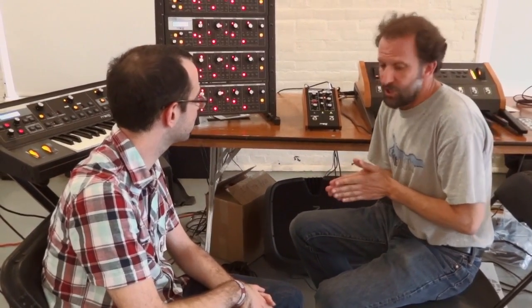The high-voltage chips are cleaner sounding, and all the support circuitry matters too. Very important is how you filter, because you're clocking — so the filtering in this type of effect is really very important. We spent a lot of time working on the sound and getting it just where we wanted it. Additionally, we added all the classic Moog things, making this significantly more of a modular effect rather than just a standalone thing, so that everything is controlled by control voltages. This makes the effect more complicated but allows incredible flexibility in the kinds of sounds it can make — allowing this Moogerfooger, like all our gear, to go outside the norms of a classical chorus/flange in all directions. That's always our inspiration.